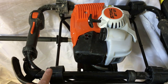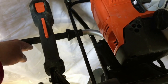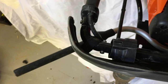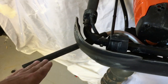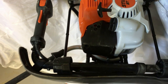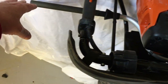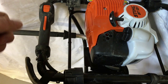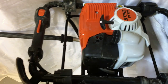One of the unique things with this particular auger is this handle here. When I started it, it's just idling — that handle's in this position. But once you're ready to start, you pull this handle back, pull the trigger, and that'll spin the auger — it puts it into gear. The reason for this is you rest your hips against here and start drilling the hole. The beauty of this machine is if you hit a stone or a tree root and it kicks and twists around violently, this bar hits your leg and instantly stops the machine. What that does is protect your wrists from jarring — it is really violent otherwise, but this bar stops that.